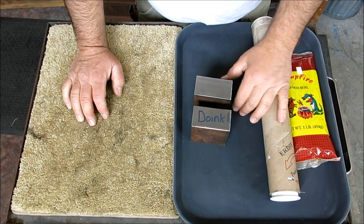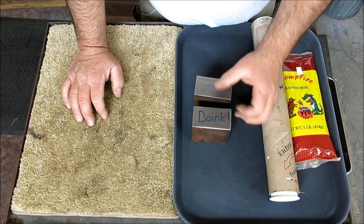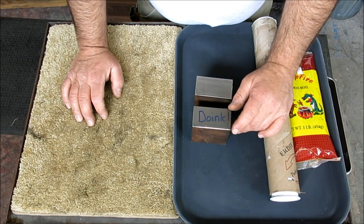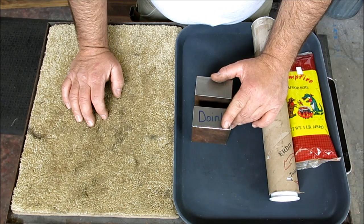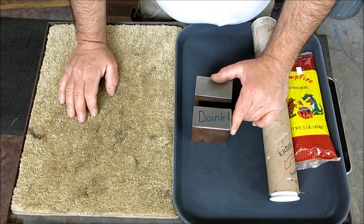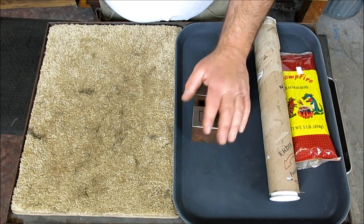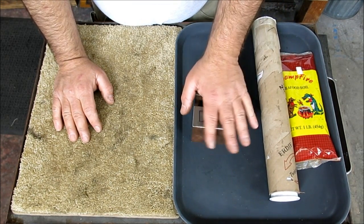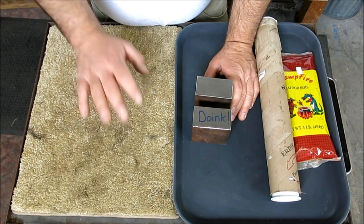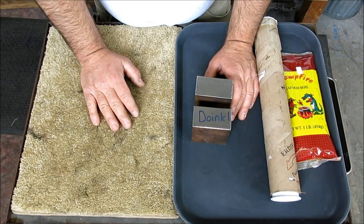Anyway, I'm going to make some cast iron 1-2-3 blocks. Cast iron is kind of an interesting material, in particular around the welding bench, because spatter doesn't stick to it. The other neat thing about cast iron is if you make stuff that goes on a permanent magnet chuck, like a surface grinder, it clamps well but releases completely without any residual magnetism.